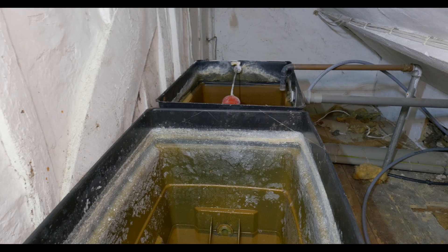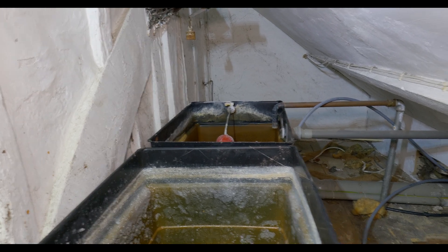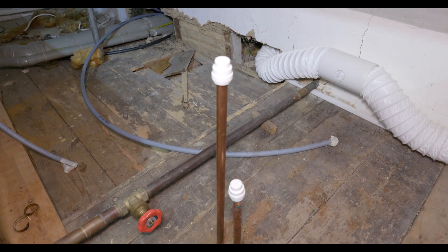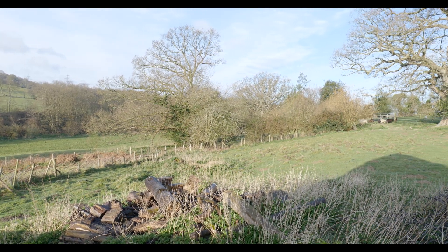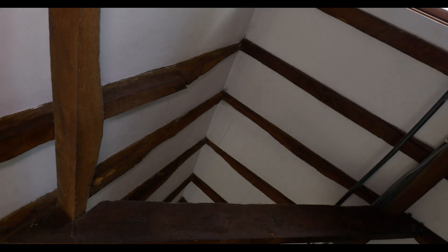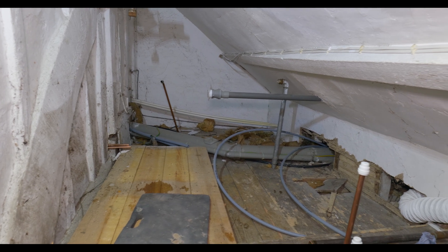These two cold water tanks are providing cold water down to the downstairs bathroom. What we're going to be doing is disconnecting the cold water main to that ball valve over there, then joining that cold water main onto this cold water distribution pipework, which will then send cold water at mains pressure down to the downstairs bathroom. All the cold water tanks are out now and I've just got to identify which pipe needs to join on to which, and then I can start getting it all piped up.